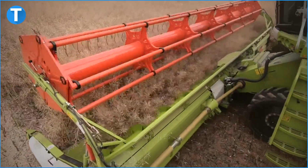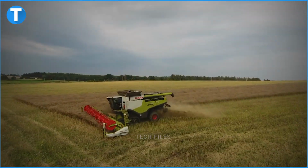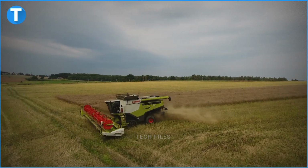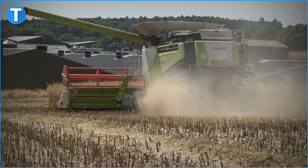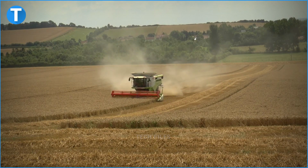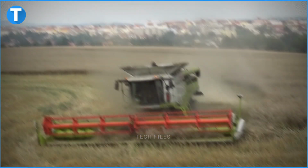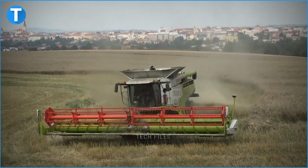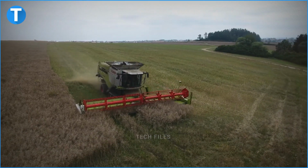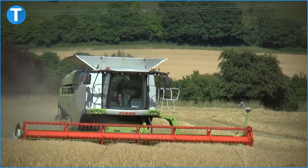This powerful machine comes with a cabin, chopper and chaff spreader. An all-wheel drive, loss monitor and rollover protection are provided on the 2018 and later versions. The standard tyres of this machine are of the 680/85 R32 and 500/85 R30 dimensions. The rotor width of this Claas product is 445mm, while it boasts of a 12,800-litre grain tank. The cutting platform width is 9.3 meters.